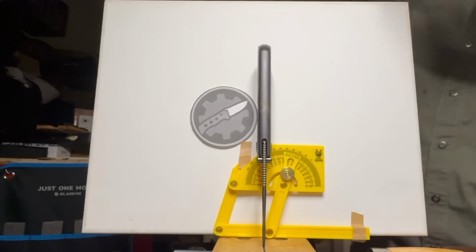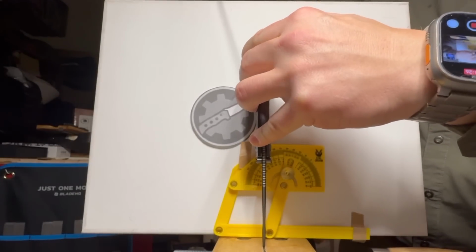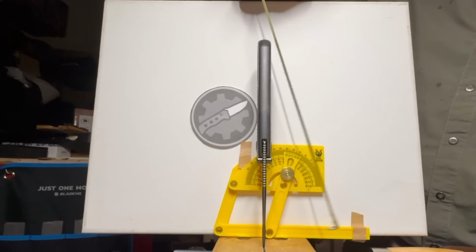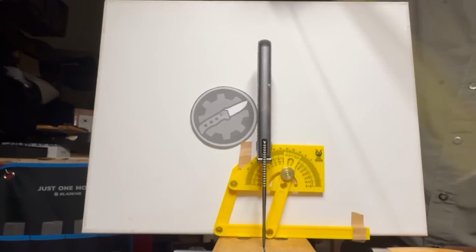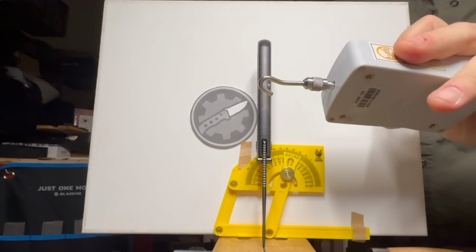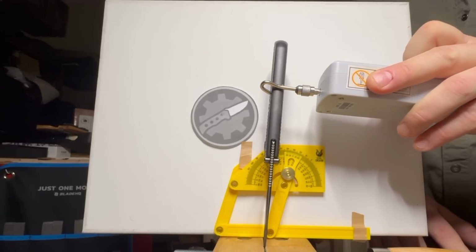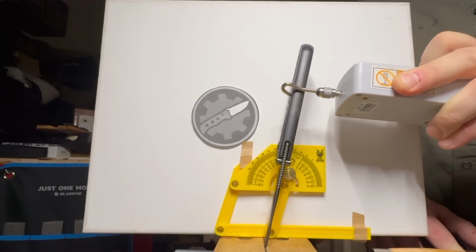So I'm going to put this blade in bending. My carpenter compass is set to 15 degrees. That's how far we're going. And I'm marking a 6-inch line from the insertion point to where on the blade I'll be gripping it. And I'm going to use my trigger gauge to pull onto the handle. I'm measuring the force in pounds, and then I'll multiply it by inches, which is 6. And that's our total. Going slowly here, I'm a little nervous.